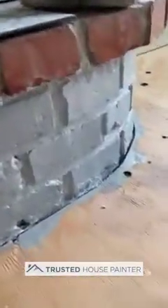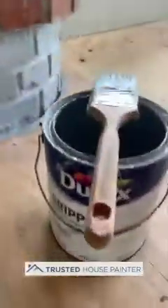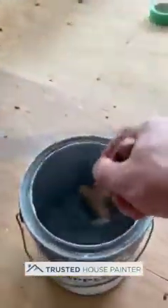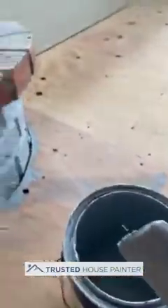The floors are not in yet, so I'm taking advantage of being able to gush it onto this brick. I'm using the Gripper and priming it — I get quite a bit on my brush and I'm kind of gushing it in there. You see how it's dripping everywhere? What I'm doing is jamming it into the mortar, into the brick, into the pores, because brick is very very porous.